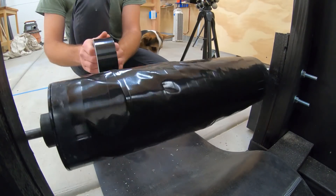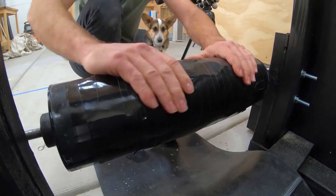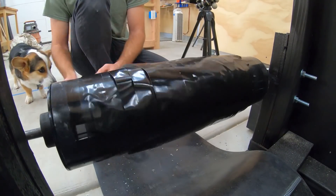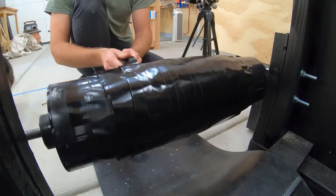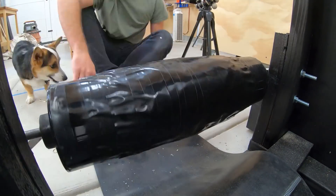It's time to crown the rollers. To make the crown I'm just going to build up layers of black tape. I'm going to start by crowning the bottom roller, and it'll be so much easier with the motor on to spin the roller as I apply the tape. I started by layering wide on the outside and working more towards the center, making a plateau about five or six inches wide.